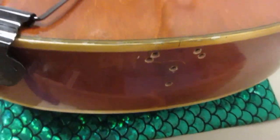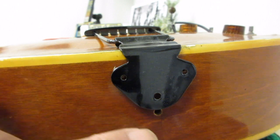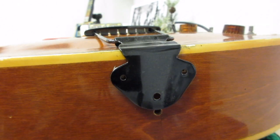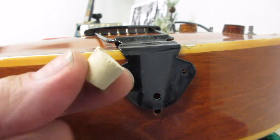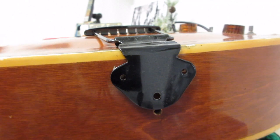It's a little bit different back here on the tailpiece. This fits on the back of the guitar, and we don't even know what kind of guitar this was originally. It's failed at least twice before with other tail pieces. Let me show you how that mistake was made. If you glue a plug and it just fits in the hole, the tension is really on the glue — and when you start pulling, yanking, or shock-loading something, the rules of the game change completely.